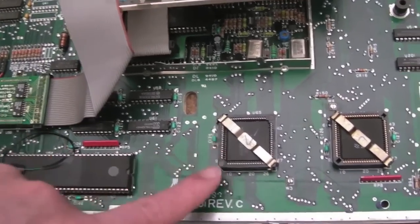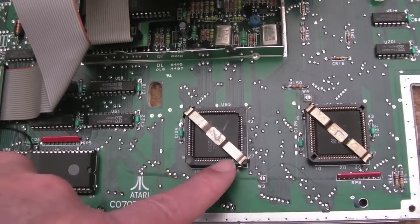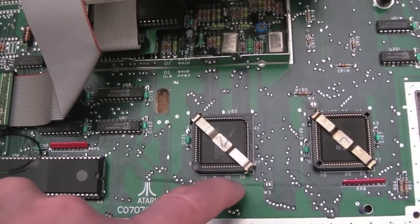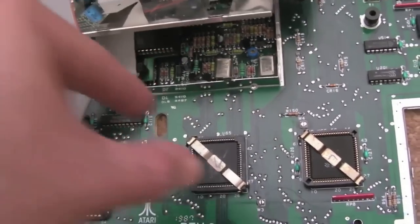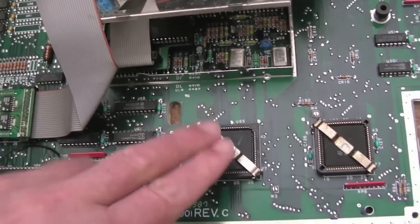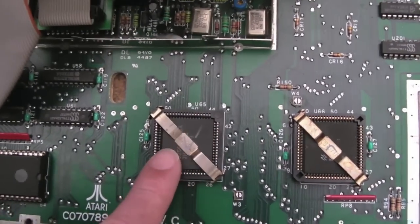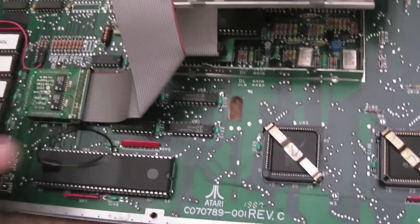If you've pressed them all down and it's still not made a difference, you need to get a PLCC extractor. I don't really want to demonstrate it now because there's a bit of a risk - you can scratch the chip and damage it. But these little metal clips, you know, they clip off. If you bend it one side, you'll be able to get it off. Then you'll have a couple of holes in the very corners at the top of the chip. You can get a PLCC extractor - it's just like a pair of pincers - you just stick them in the holes and squeeze it, and very carefully prise the thing out. And then you can just put it back in, making sure you get it the right way around. There's a notch on these that shows where pin one is.